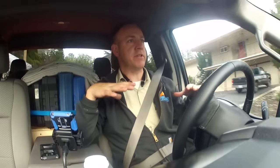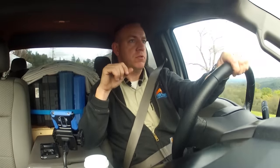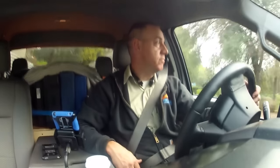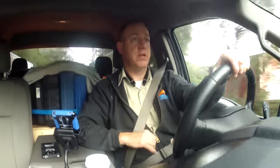Sometimes I forget to start eliminating components — like, take the compressor out of the scenario. Just unplug the compressor wires and see if you still get a short. So I took the compressor wires off, went to the breaker, plugged it all back in, flipped it on — the breaker did not trip. But when I got outside the fan motor was running, which was really weird because the system wasn't calling for anything. Apparently the fan relay on that defrost board is in the normally-closed position. We then did the same thing in reverse — took all the fan wires off and just hooked up the compressor, and the breaker tripped.